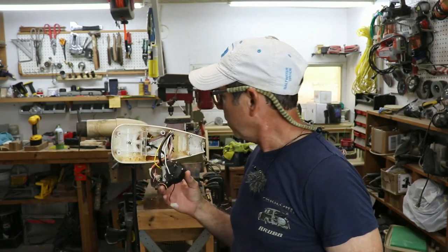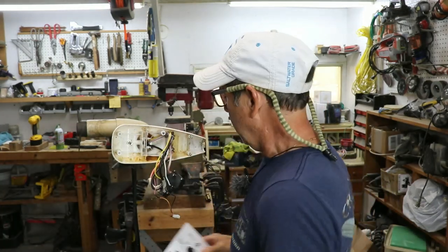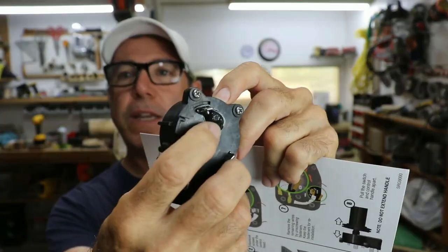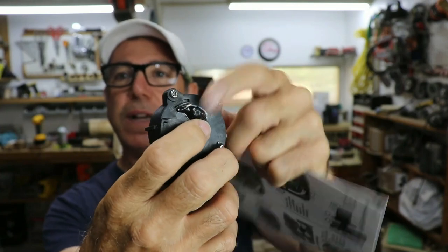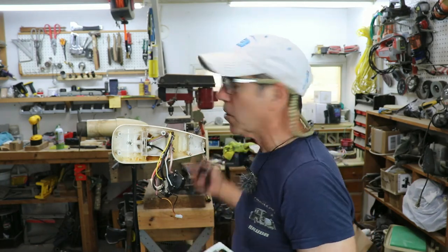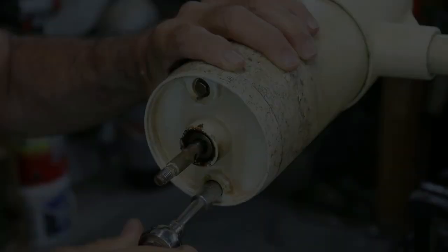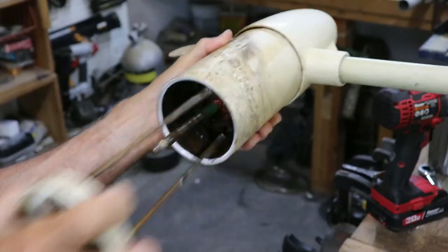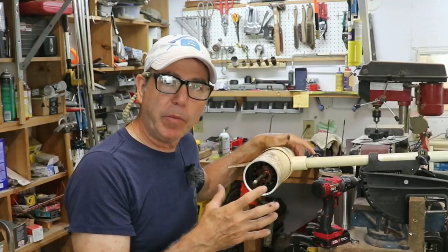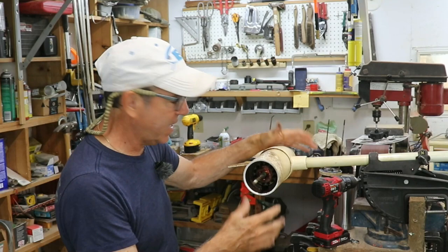Before calling them I figured I'd double-check my wiring against the schematic and the photographs on my phone — I've got it right. But I also noticed that on the old speed controller, it melted: it got real hot on the inside and melted stuff out. If it was hot enough to do that, it may have damaged some of the wires going down to the motor. I'm going to pull the motor apart and see if I can find a flaw — maybe running a new wire will fix it. This is exactly the experience I had with both my Minn Kota and Motor Guide motors — when I pulled them apart, they all had water in them.